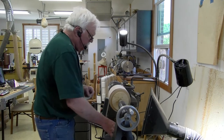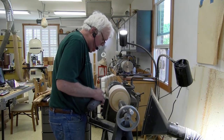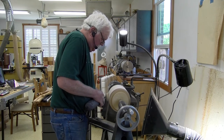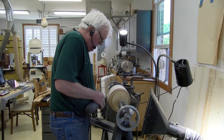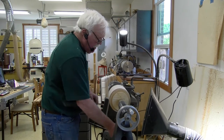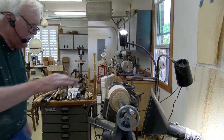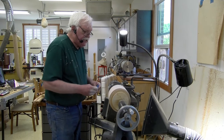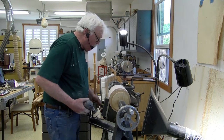That was 120; here comes 150. Something else to keep in mind: this seems to be cleaning up real well, but with a dark wood like cherry, sometimes if you shine the light on it you'll see circular scratch marks from the sanding pad. Then you take your sanding pad and go with the grain and they'll come off until you get to the next grit. Okay, we're back at 150.